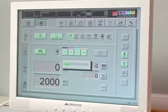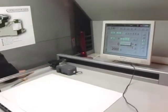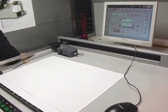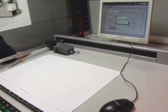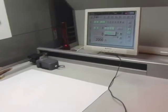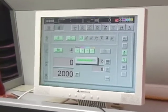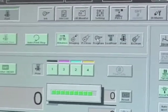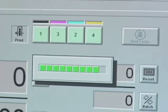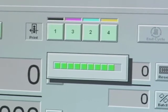The press is going to take the old plates off, wind them into a take-up cassette, and leave four fresh clean plates on press without the operator getting involved at all. After that, we start imaging — it takes 4.5 minutes to image all four plates on press. We then take 2 minutes to clean those plates without any chemicals, so it's a very environmentally friendly printing press. After that, it takes about a minute to preset the ink keys automatically. So in 9 minutes, I'll have 20 sheets coming off the back end of this press in perfect registration at 2540 DPI at 300 line screen.